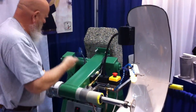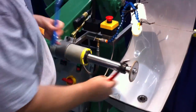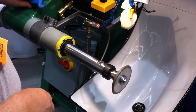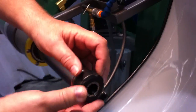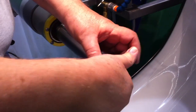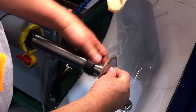It's all totally enclosed. We'll tighten this back up. The working end — this whole spindle comes out. There are collets in here. This can be adjusted; there are collets that can go in here, and you can hold up to 1 1/8 of an inch or smaller. So this fits in, and that tightens up like that.